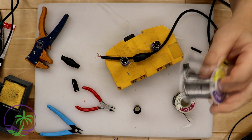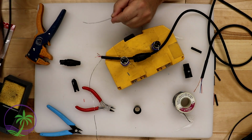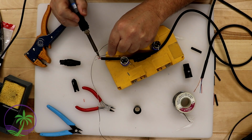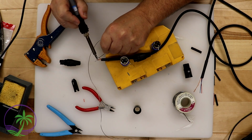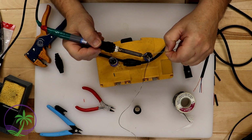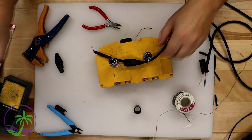Now the cable, in my case, that's from another one of my suppliers, and that happens to be a Digiflex Pro cable. It's generic cable, but it's good quality. It's certified. It's got all the proper paperwork for it, so that's a good thing. What I'm doing right now is I'm basically putting actual solder, which they call tinning, onto the actual cable and now onto the connectors.